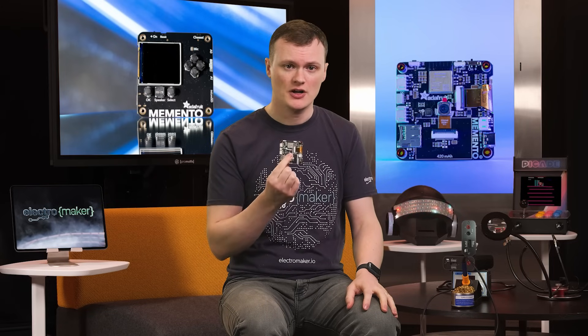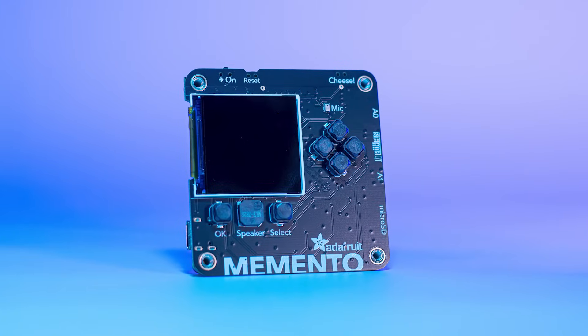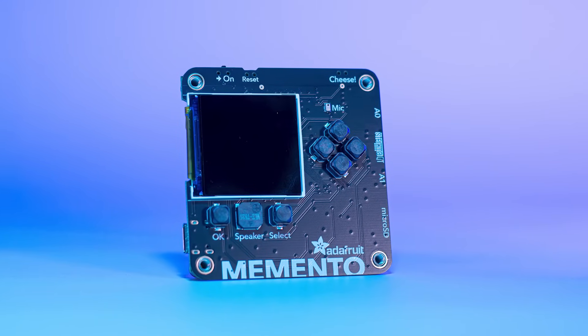This kit also features an OV5640 5-megapixel camera, which integrates an internal JPEG encoder so you don't need to do any messy bit manipulation. It also comes with a 240 by 240 pixel color TFT, microSD card slot, two digital and analog STEMMA ports, I2C STEMMA port, LIS3DH accelerometer, analog microphone, buzzer, six buttons, separate shutter and reset buttons, and breakout pads for UART — and more. It's incredible how much you get in this one device.